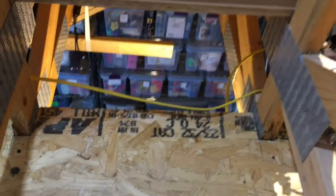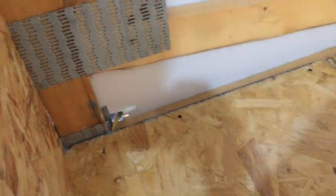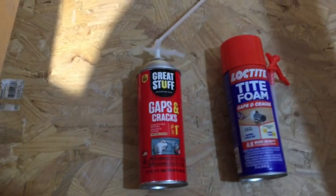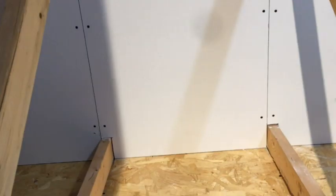Now back to the front wall of the closet — we have these holes down below, and I will cover them with OSB. I won't go into the details in this video, but I wired out of the back of that outlet over to this switch, which leads to an outlet here, which turns on that light. Since this is somewhere between a closet and an attic, I'm not going to mud the drywall or put in fancy flooring, but I will fill in gaps like this where you can see light below. I was going to use Great Stuff, but this Loctite foam is white, so it'll match the drywall a little better.